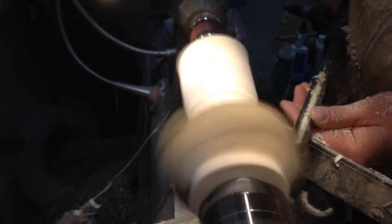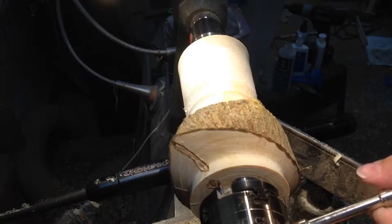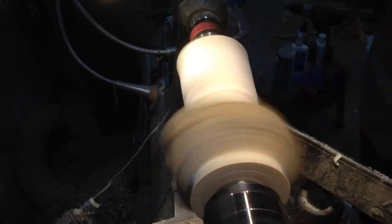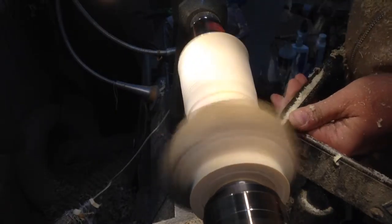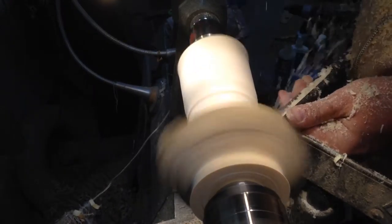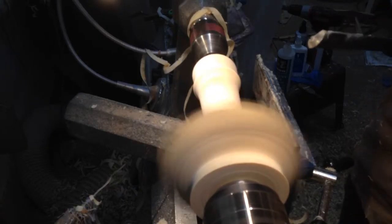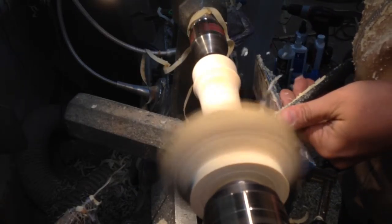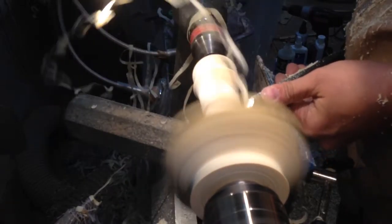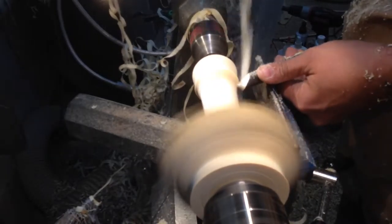At this point in the video I've sped it up even further. I've switched to using a spindle gouge. I also was having trouble with my chuck — I had to keep stopping and re-tightening it. But I'm just making detailed passes at this point, now refining the stem shape. Some beautiful curls coming off right now. I'm very happy to have the wood cutting well.